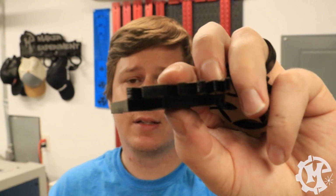Since the half inch acrylic was kind of a fail, I am using 1/4-inch acrylic, and I was starting to stack them up and noticed that 2 layers at basically 1/2 inch just wasn't giving me that depth that I was hoping for. So I decided to cut a 3rd layer. So each one is going to be about 3/4 inch thick. So what I'm going to do is go ahead and stick the layers together and get these pieces set. And then we'll go ahead and make the mold casing or the box around them. But let's go ahead and stick these together first.